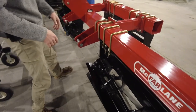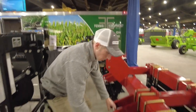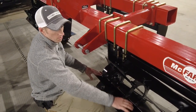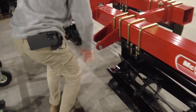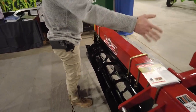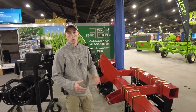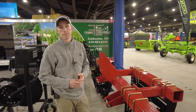That's a big issue whenever we're talking about cover crops in general. Nice three-point design, and we've got replaceable guards on here. This crimp mechanism is fully replaceable — you can simply unbolt them. There's going to be five bolts, and when the day comes that they've gotten dull, it can easily be replaced. It comes in three gangs, and the middle one's a little bit narrower than the outside, but really a nice and clean crimper unit. We also have a 30-footer on our lot back in Coldwater, so come join us at the farm show or give us a call to learn more about cover crop crimpers. Thanks for tuning in.